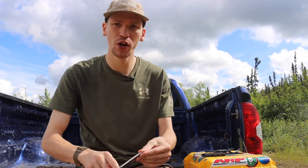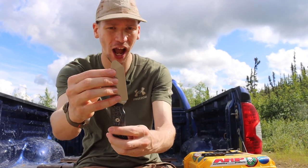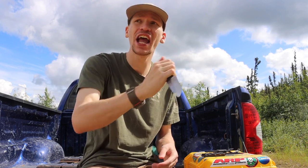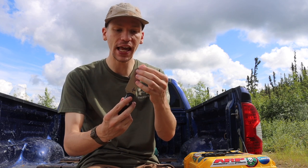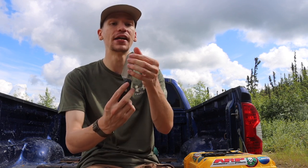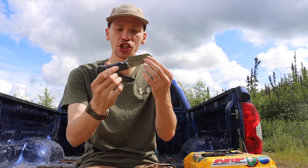What makes the TWR a more truthful, honest-to-god sharpened pry bar is that this tip is very much for prying, and it is legitimately sharpened — you have a bevel here and a bevel here, and the tip is essentially right about here. This thing is designed to be stabbed into things and pried. The sharpened blade isn't razor sharp, and you don't necessarily want it razor sharp because you're jamming it into things, but because it is sharpened you can jam it in and crank either direction.